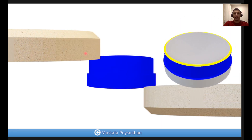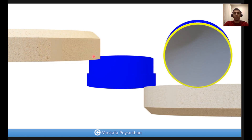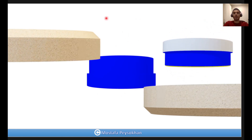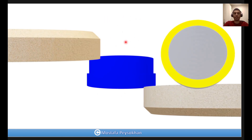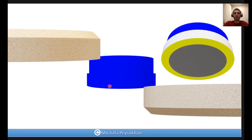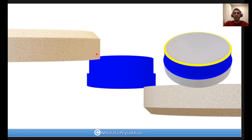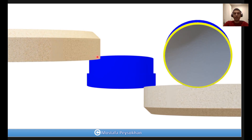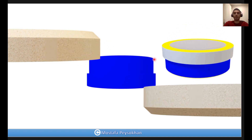For the second step, the grinding wheels go to the top and make one flat surface. Here we have the two cups that hold the lens, as I explained in the previous lesson. We make the top surface flat and the bottom surface flat. For making the protective bevels, the grinding wheels go to 45 degrees and move along the edge.